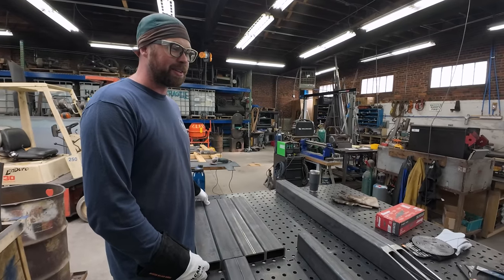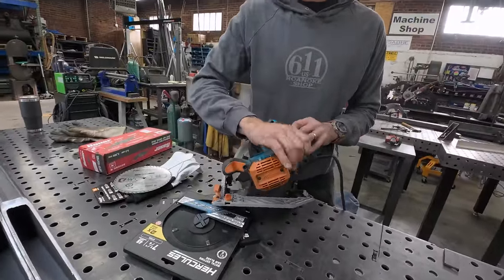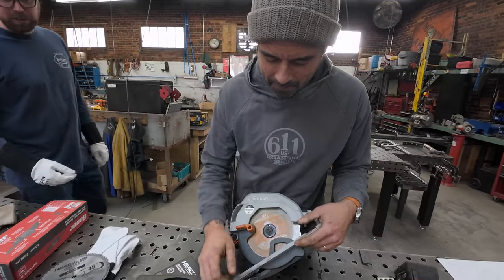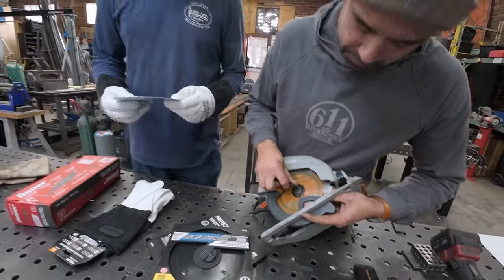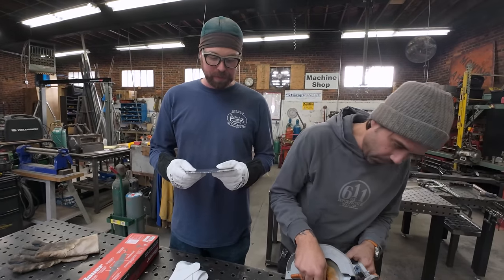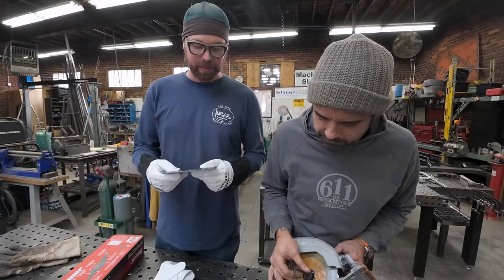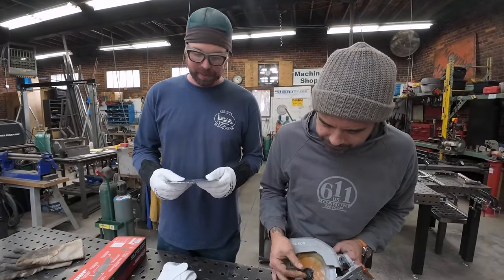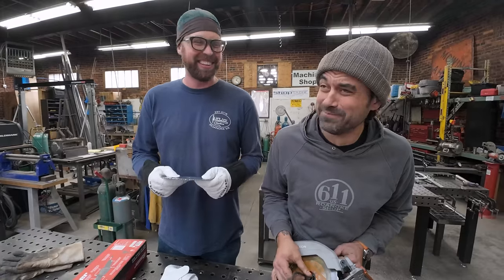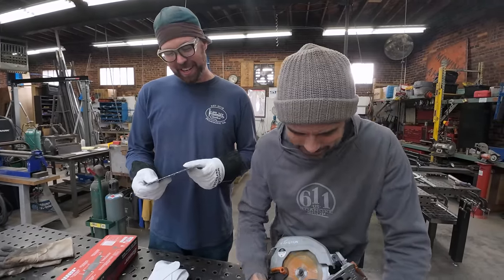Aaron finally blew the carbide teeth off the Evolution saw blade, literally right after we talked about how great it was and how durable they were. My prevailing theory is that the saw blade got hot enough to bring the solder holding the carbide tooth onto the blade to its melting point, upon which the teeth left the chat. So I may have felt a couple of those hit my face.